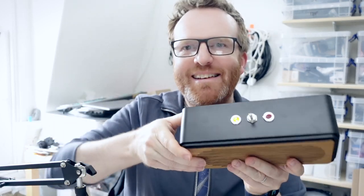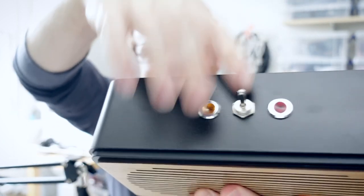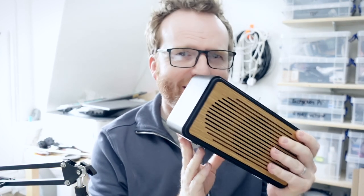That's the new on/off button — pretty chunky. The two lights on top: one is for power and this one is for when you charge it up — the charging light. Despite the ground loop isolator I've actually still got a bit of noise, and I think it's because right by the speaker there's a coil on the main board that's interfering. I could try shifting it around a bit or maybe put some grounded copper tape over it. Perhaps you've got some ideas — it'd be great to hear them in the comments. But other than that it works really great.